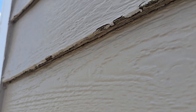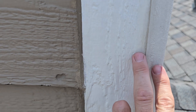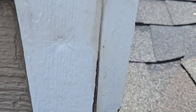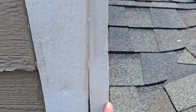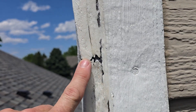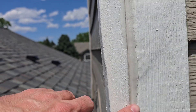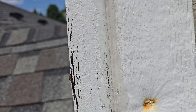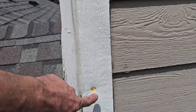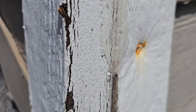This is not fully engaged there, but let me show you how the board thickens. Track with me this right-hand board as we go down — it's one and one-eighth inch thick. Do you see that? That's not a camera angle, that's an actual change. This one's almost an inch and a half. Let's look at the other side — we're just going to track visually down this board to see how much it swells. This is not real wood, folks, this is press wood. We know that water is entering the building material, beginning it to swell, and it's coming through the joints. So we track the water flow down — see how much smaller it got there? It's getting bigger, it's getting smaller. It's an inch and a quarter, back to an inch and an eighth. And then down here, the pièce de résistance — we're almost two inches thick at the bottom. Look at the nails, look at the puff — it looks like upholstery, actually. The wood is all swollen.